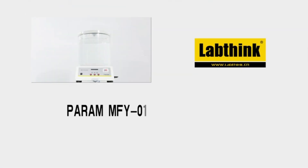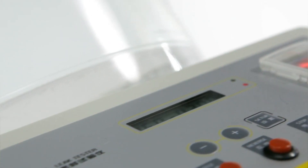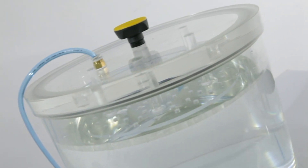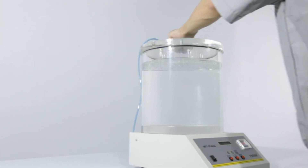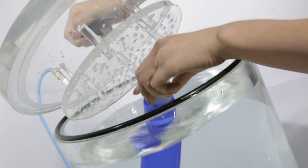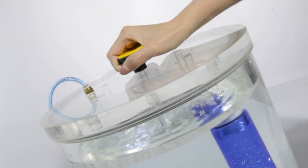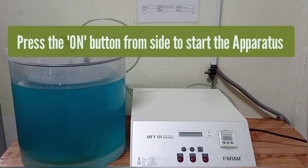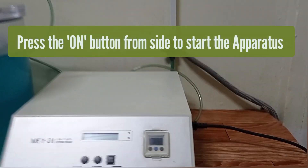Welcome to this video. We will learn how a leak test is performed to check if the sealing of a product is OK or not OK. This test is performed by dipping the sealed product into a vacuum chamber, and then pressure is maintained at 60 kilo Pascal for 30 seconds.